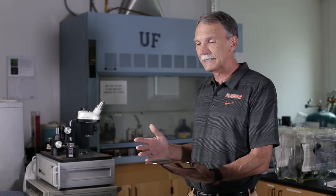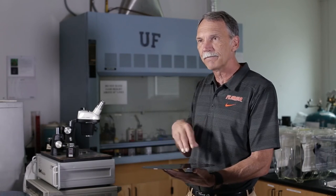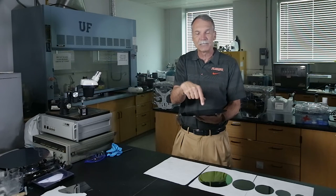Then you're going to spin on a photoresist. A photoresist is a thin plastic layer that goes over the surface that's photosensitive. Then I will put it into a system in which I can expose that photoresist and open holes in it. That allows me to do things like etch or add impurities through ion implantation or other processing steps where I'm going to actually go about making the transistor.